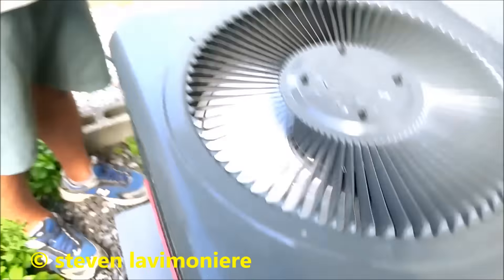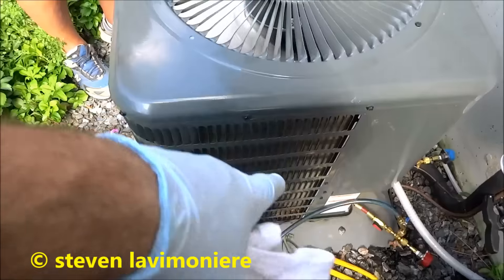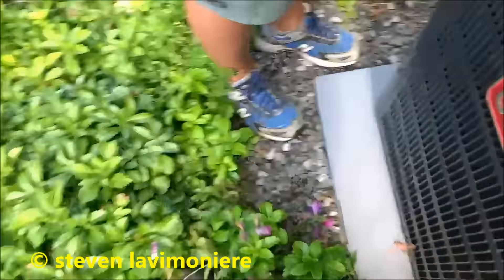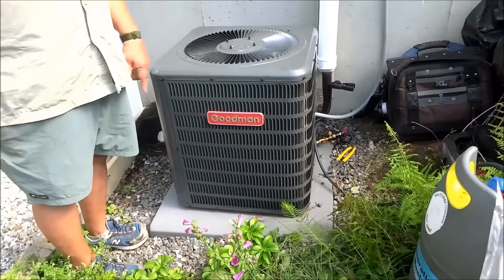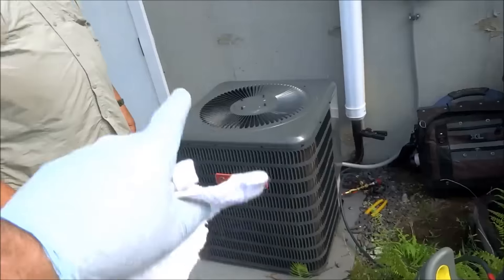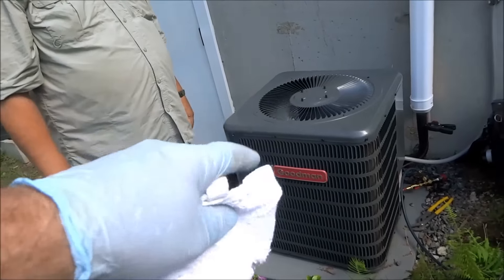Is that a good company? Yeah, they're alright. So I want you to get the hose and clean this all out, blow out these sections, and keep this clean. Okay, with the garden hose. It's not really dirty — it's only a year old. But just get the little dead matter out of there with the hose and spray this coil down every couple, whenever you cut the grass. I always say keep it clean.